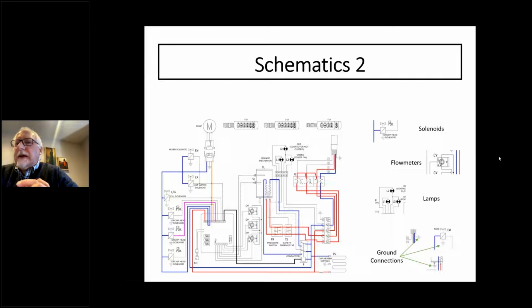The machine I have here at the house, even the panels that come off the side of the machine have ground wires connected to the panels. The idea is if you remove something from the machine and have it in your hand, there will always be a ground actually connected to that thing. So when it shorts, it doesn't ground to you, it grounds to that wire that goes back to the machine. So you'll see ground connections everywhere. Do not fail to reconnect a ground.